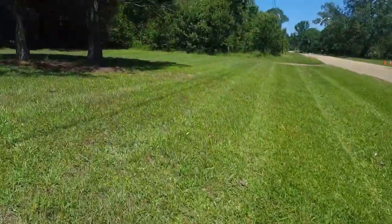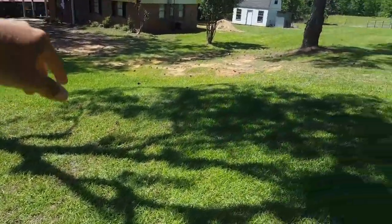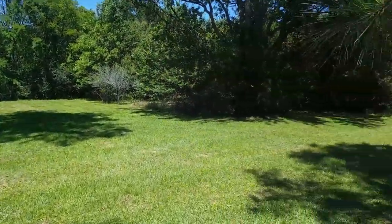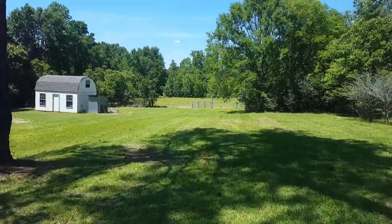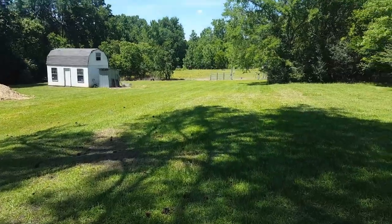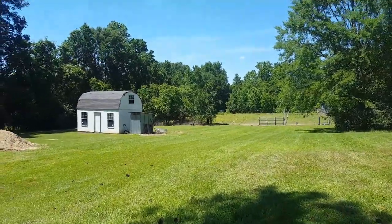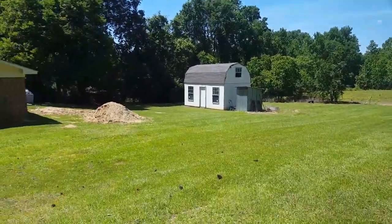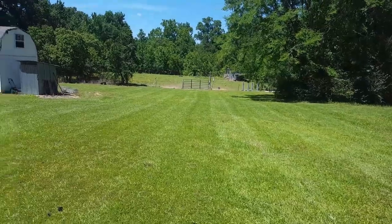The yard's finally starting to stripe nicely. This dirt spot is where the previous owners used to park and ride four-wheelers, but it's starting to stripe up pretty nicely here. Just figured I'd give you guys that quick tip — adjust those wheels. Three inches and up you can run the bottom hole; if you do anything below three inches, or cut a lot at three inches, move it to the upper position. I appreciate you guys watching — like, subscribe, comment. Sorry for the non-edited video, just making a quick one for you guys.